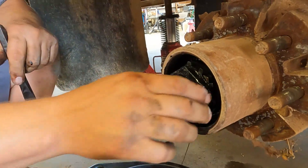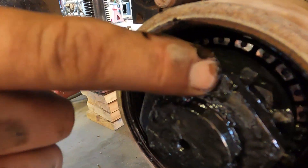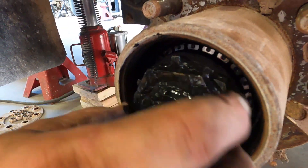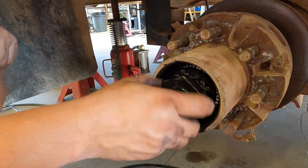The outside nut is normally going to be the tightest. If you do it with a chisel, you'll see a little sharp mark where it cut in — that's perfectly okay. The only issue is when you go to re-tighten it, be aware of that sharp mark because you can cut your finger on it. You may want to buff it off with a grinder or file it down.